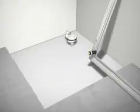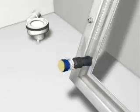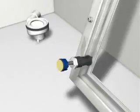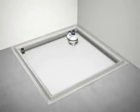The ESR is simple, quick, and straightforward to install, and everything comes in one box with clear installation instructions. First, connect the siphon trap on the drain side. Then adjust the fully sound-insulated feet both horizontally and vertically to compensate for uneven floors or to avoid existing pipes. The installed height of the ESR can be continuously adjusted between 78 and 162 millimeters without tools.